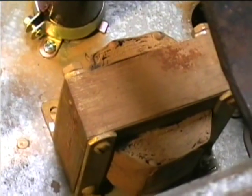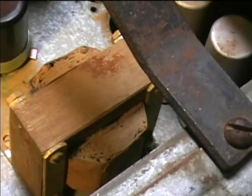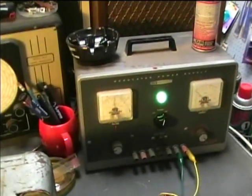So it seems like, unfortunately, there may be something going on in this transformer that's producing noise — possibly some kind of arcing. Because when I turn off this power supply and the 6F6 plate voltage is withdrawn, the noise disappears.